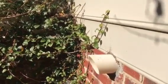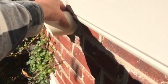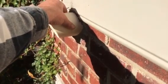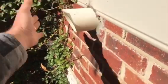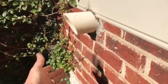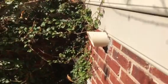or if I did anything, I would saw it straight and put a coupling right here, which would be what's called a break-off joint. The city requires it, the county doesn't. We're in the county. But that'll let me add a foot-long piece of pipe with a sharper angle cut on it, and then I'm happier with that.